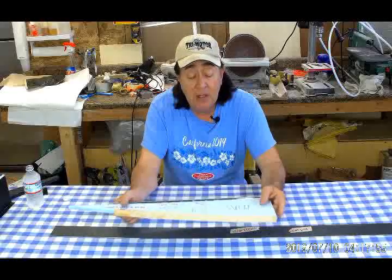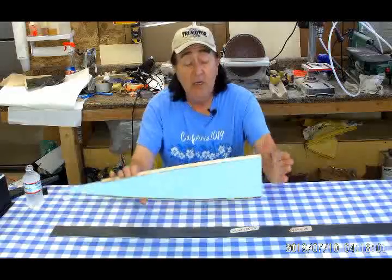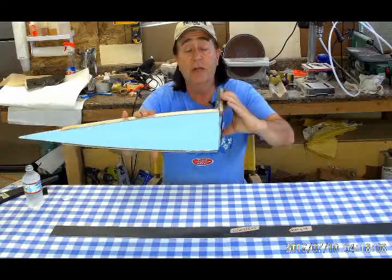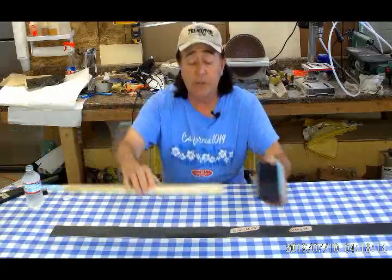This is the rib for the mean aerodynamic chord — this is the average rib length after the spar. The shear web would be like this, and this fits in here sort of like this. I'll line it up so that the spar cap lines up with the D-tube.